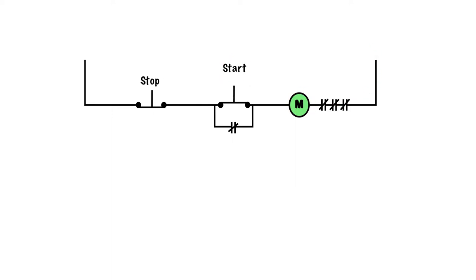We'll let go of the start button, which will bounce back to its original normally open position, but M will be held in. This M coil will stay energized because of these holding contacts or sealing contacts, because it now has a parallel path around that start button to keep M energized. So it basically holds itself in.